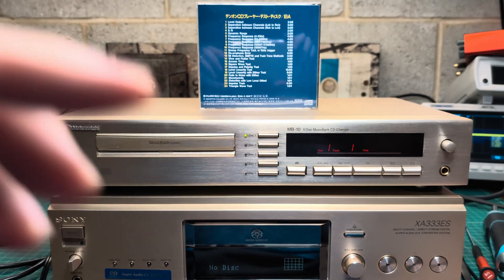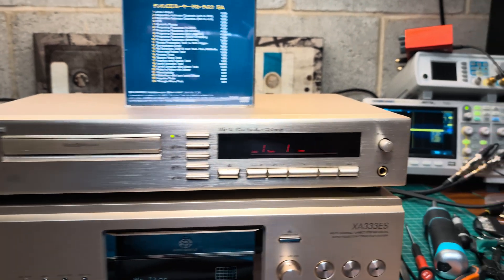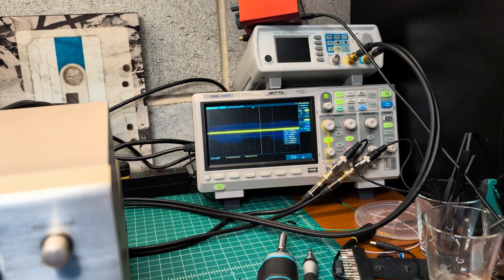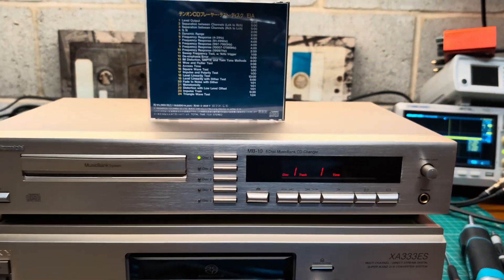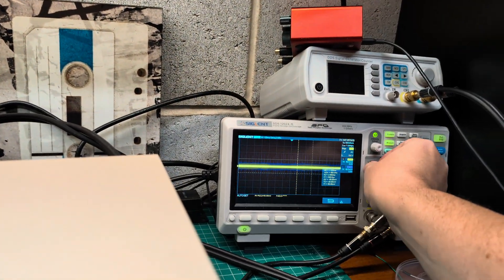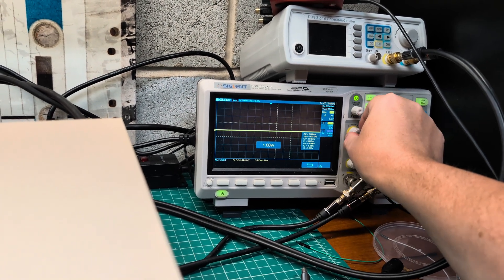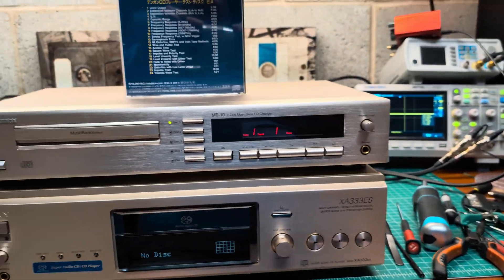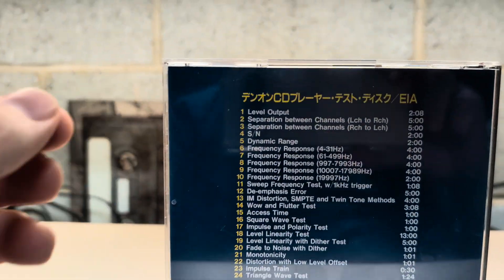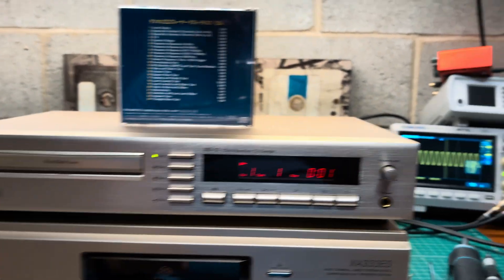Let's do a set of tests, and then we will be comparing disks. You see there are a couple — some noise on the oscilloscope. I will turn off my LED light. And to start with, we will start with a 2-volt square. The first would be level output — I've already tested both, they give the same level.